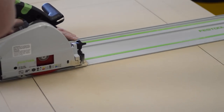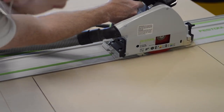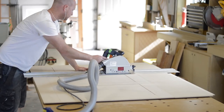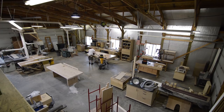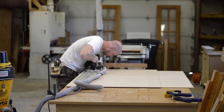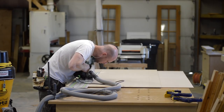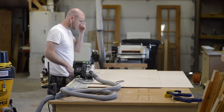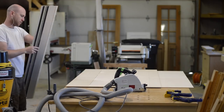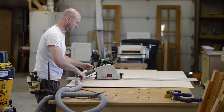I'm cutting openings in one continuous piece of MDF. This really has one main advantage, and that is there's no joinery - and no joinery means no clamping. Also, when you paint the panels, there's no chance for a seam to show through. This method works best when the walls are less than eight feet long. If the walls are longer than eight feet, you'd have to butt joint two pieces of MDF together, and that would kind of turn into a nightmare.